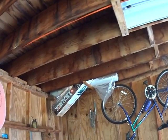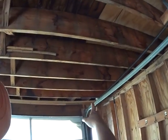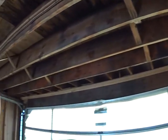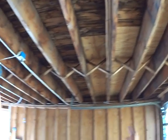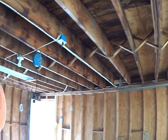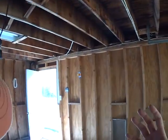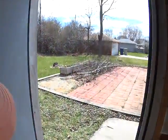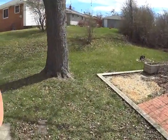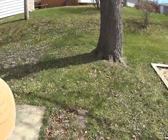So there is a rubber roof above. It could have been repaired, and so all this could be old. I would say that you don't have any, obviously, issues with any of the joists in here, and all the bridges look nice, everything is nice and clean, nothing is bowing here. So I would at least say unknown for roof above. Possibly you're going to have to get that roof replaced. And it is a rubber roof.